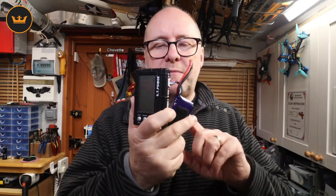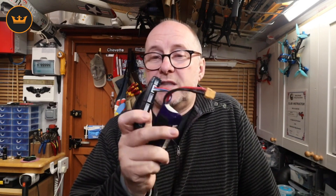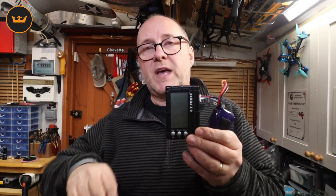For example, this battery was way out. I don't know what happened — I haven't used it for a while. Started to charge it and it was a differential cell, which made me a little bit concerned about this battery because the cell voltages had drifted a bit. So it tells me that this is getting towards the end of life. So I left it plugged into this on balance, left it overnight, put it in a metal box — I'll show you the metal box now — and left it overnight.